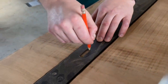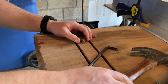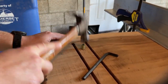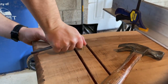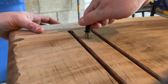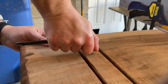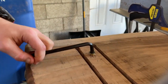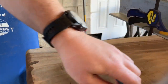We identified where we were going to drill and drilled the holes. Then we set the inserts — just getting them started and screwing them down with an Allen key. This went pretty easily. I did not mess around with CA glue or epoxy — I didn't really see a need to do that. These inserts are in there very tight, and I didn't think epoxy or CA glue was going to do anything additional. They go in very easily once you get them started.